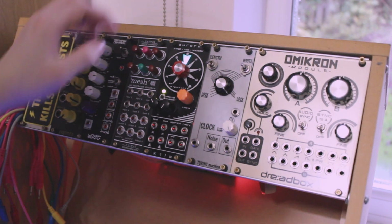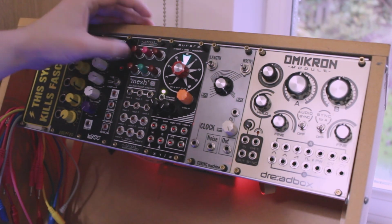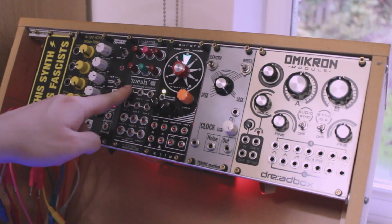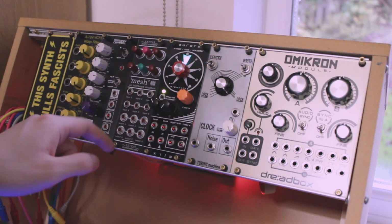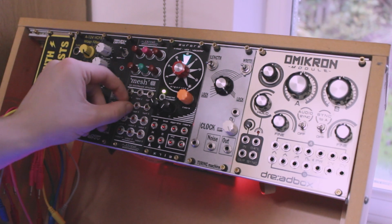Basically, you've got input 1, output 1, and knob 1 here, and 1 to 6, and each of them is just a passive attenuator. But the cool thing is, if you plug into one of each row, but don't plug into the other two, it's actually normal to the other two. So I could plug something into one and take outputs from 1, 2 and 3, send it to 3 different places. Each of them is attenuatable. Same with the bottom row, 4, 5 and 6.